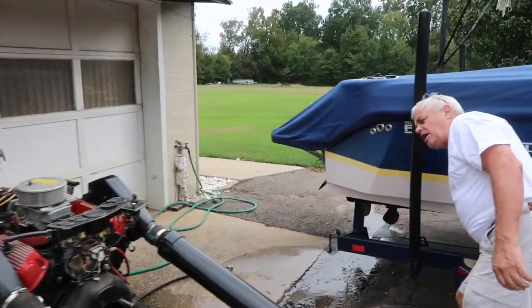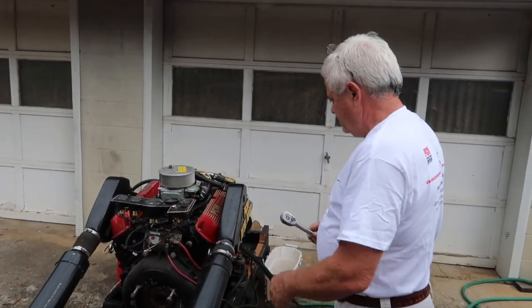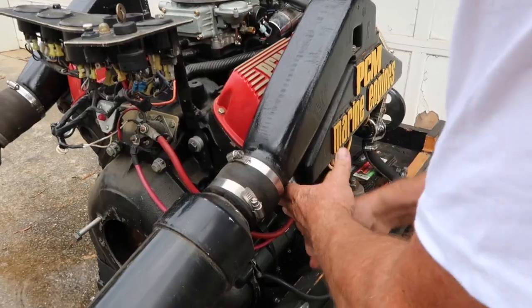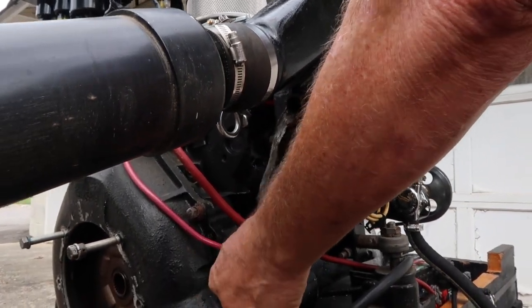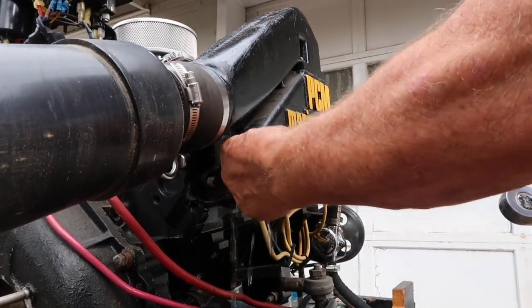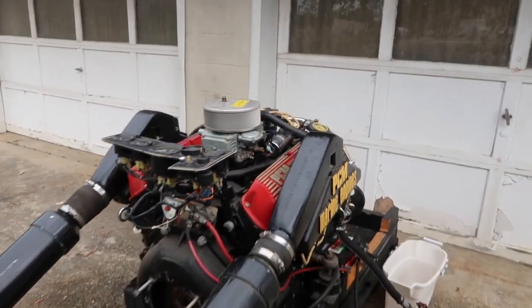You also have two exhaust manifold plugs, and usually all you need is a half-inch drive ratchet. These are located on the back of the exhaust manifolds. I also want to drain those. You can see there's quite a bit of sludge and stuff that comes out of these manifolds — I like to dig in there a little bit with my finger and clean that sludge out so you get good drainage. Then you do the same thing on the other side.